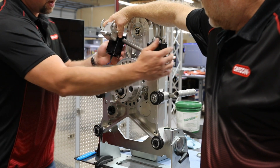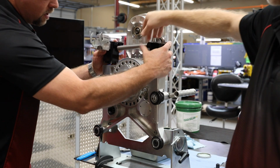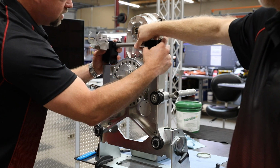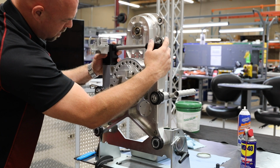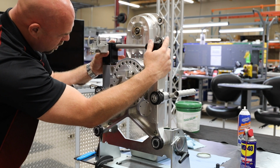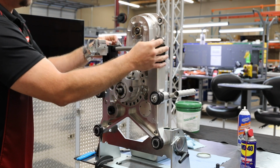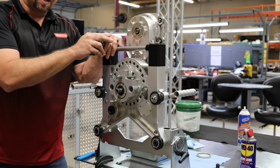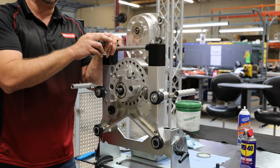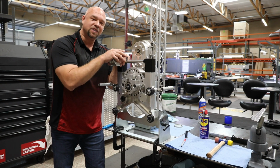Alright, now as I put these cover housings down, I'm just going to make sure everything's assembled back together in one full assembly. I'm going to seat them back down, making sure I don't pinch any wires, and get those O-rings seated back into place. I'm going to tighten my screws on top, and we've officially changed either our arm feed motor or our travel feed motor.